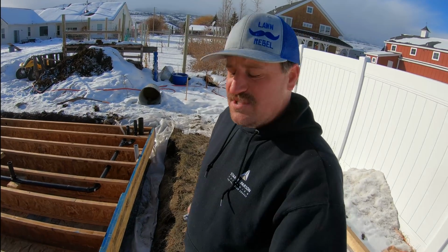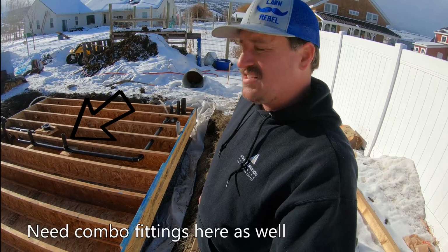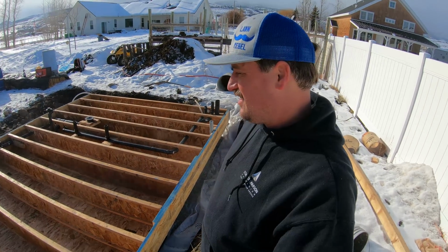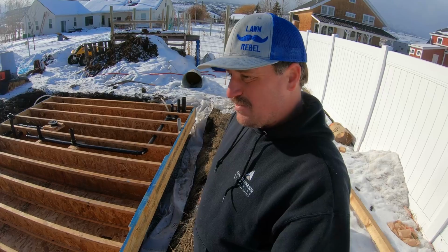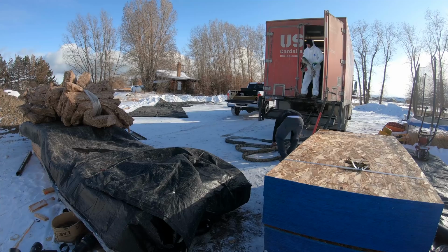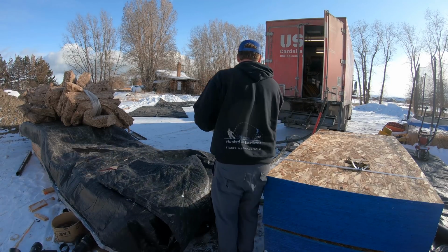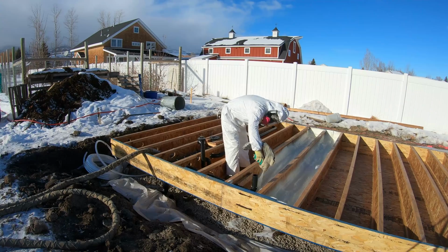So normally in a foam situation, you've got to mask the areas that you don't want to get foam, because the stuff kind of just goes everywhere, but no masking here. Should be quick and dirty. Then I will put the bats in there. So 2 inches of closed cell, which is going to be sweet. Should make for a nice warm floor. So he said that the hose has to warm up, not the chemical, but the hose. I don't know. Apparently the hose.